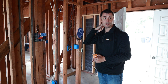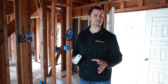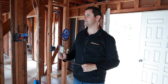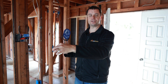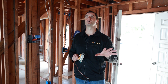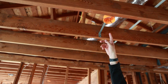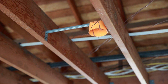As a builder, it doesn't cost much more than a traditional system — it saves labor and definitely saves on material for the wire. Instead of 14-gauge Romex we would have run, we run 18/2 to the fixtures and 18/5 between the boxes where the drivers are. Huge cost savings, especially in a big home like this. The wiring starts at a low voltage panel home run in the garage — we have 10 home runs for this house, so 10 18/5 wires that distribute out throughout the house and connect to the drivers, which in turn control the lights. I want to show you the light boxes in the ceiling — these rough-in boxes — and ATX LED has his own proprietary boxes.